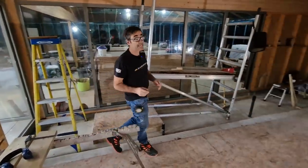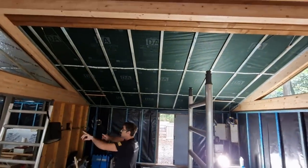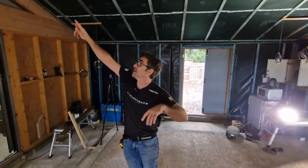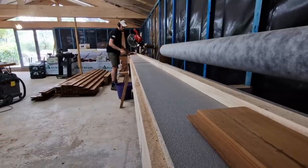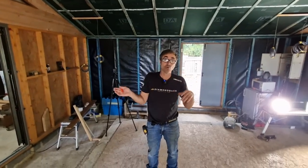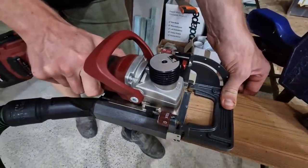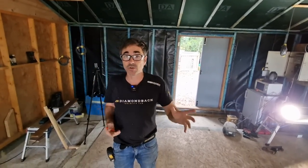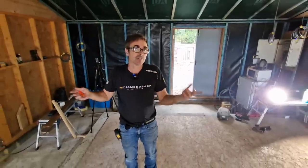And then Ed's already making up the next courses on the other side. So just to recap, we've got a very long saw table. It has a set stop, which is a certain distance from the blade, okay, which represents glue lam to glue lam. And that enables Ed to put a square end on the first one, slide it along, square end, and keep pushing them in and gain courses. Then using the Lamello, we're not having to cut back onto each rafter, and that could be up to 560 millimeters we'd be cutting off. And if we were doing that on every other course, say, and we've got all together something like 66 courses, it's nearly 33 meters or something like that.